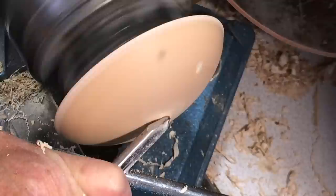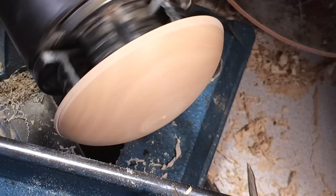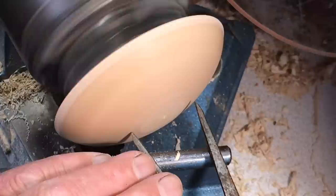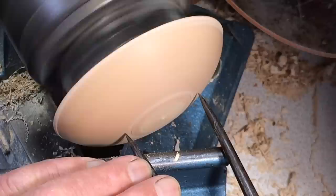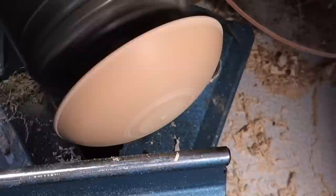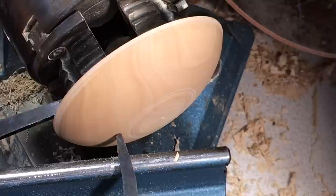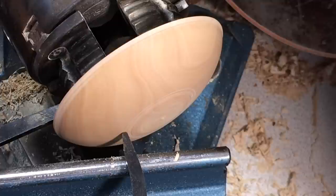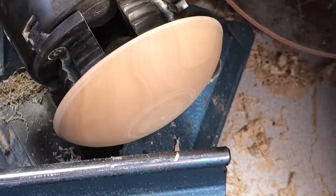Now the question is: do I have enough wood? I've got two places where I would like to have a foot - really the wider the better generally. These are dividers set to chuck diameters, so I can go to that diameter or this diameter, which I would prefer. Making a mark with the left that lines up with the right. So what have I got inside? That is the crucial point - get some calipers in there and find out. That is how much wood I've got, so there should be enough wall thickness.